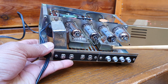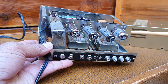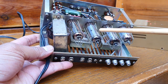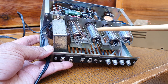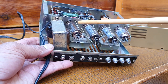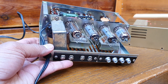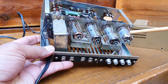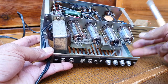You can see two audio transformers here. They are working like a Class A configuration. This one is a preamp for the phono and the driver stage. These two tubes are each independently amplifying an independent channel — left or right. If you select mono, they are both parallelly connected to the circuitry. This driver drives and feeds both. This tube handles the phono cartridge input, which is a very low level compared to line level and needs amplification, so it serves as a preamp. Very simple circuitry.